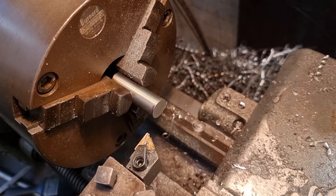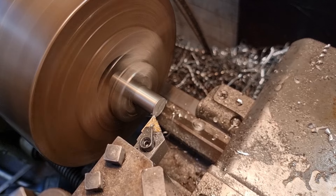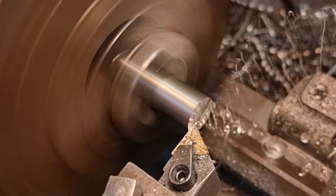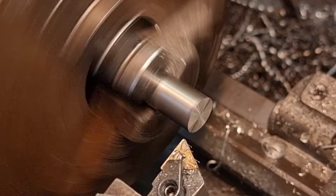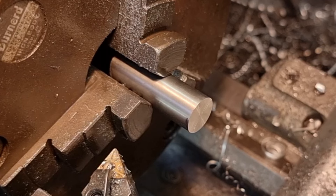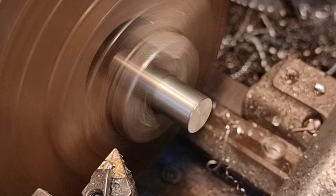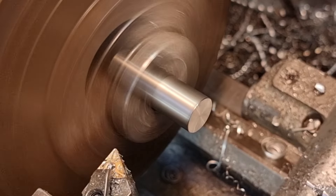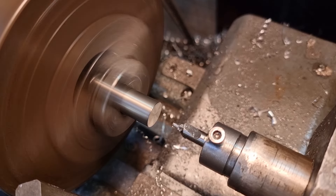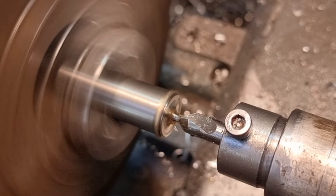I'm hoping you can hear me because I've got the heaters ramped up. I'm just going to make a couple of spacers to stand off the rear master cylinder, so I'm just facing up this bit of stainless tube. We'll get an M6 or 6.5mm hole through the middle. That's faced off — let's just break that edge. Coming in with the centre drill — everything's a bit cold. We can get in, centre drill things — a little double loop. That's what separates you from the animals — check out the merch in the description below.